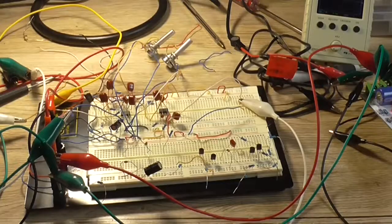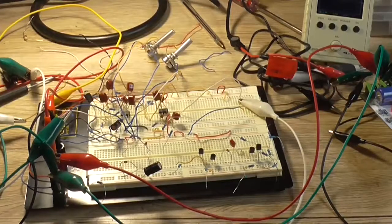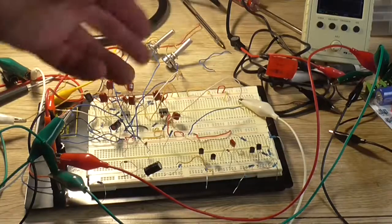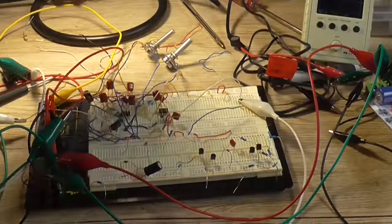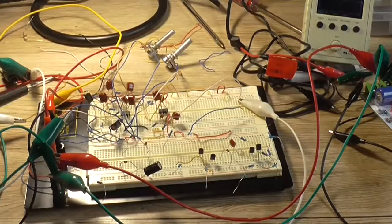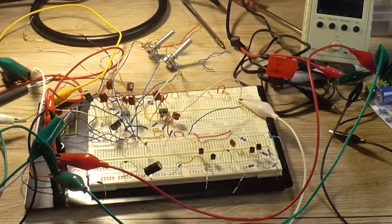So anyway, I think I'm going to leave this video here. I'll just start the CD player going again. This is part one. This is basically the input stage, working out the gain and the mixing op-amp section. In the next video I'll go into the output stage that's needed to go to the power amp, because we're going to include a master volume control, which means our total output gain with all the tone controls in the middle or flat is probably looking at about 12 volts peak to peak. So that's going to be it for this video.